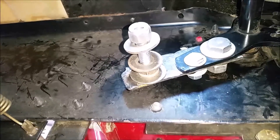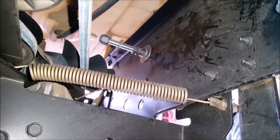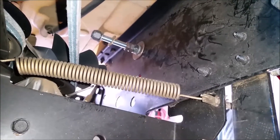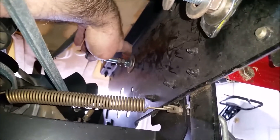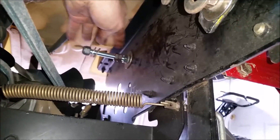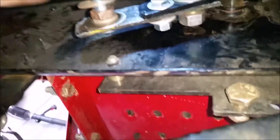Quick update: I got the new hardware. To show you how the linear actuator is going to be held in place — I've got a carriage bolt sitting down there bolted to the side wall of the frame, sticking out. It's a four-inch long, half-inch carriage bolt. These two nuts here will be used to center the actuator where it needs to be, and it's going to go between the two washers.